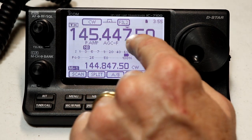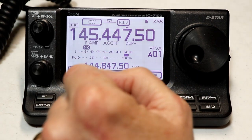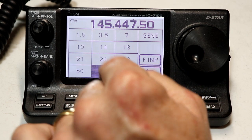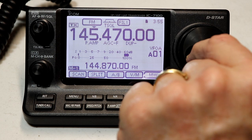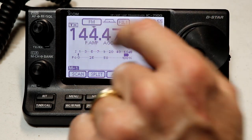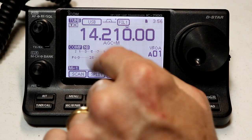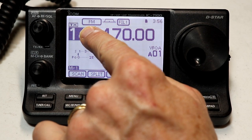That's it for the step size in the kilohertz range. You do have one other step size — briefly tapping the kilohertz digit turns that mode on and off. You can also select a much larger step. If you press and hold the megahertz digit, you get a little down arrow above it, and now your tuning step size is one megahertz. This works on HF or any of the bands. You don't get any choices — you can't make it five megahertz or something different. When you switch bands, it automatically drops out of the megahertz tuning.